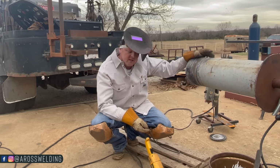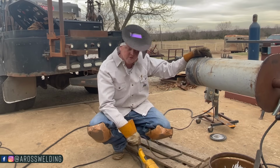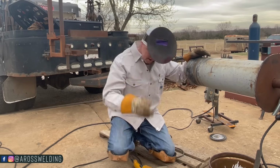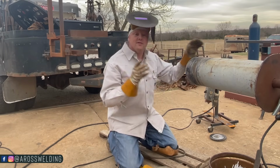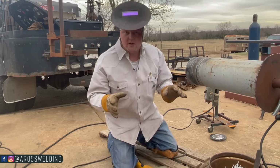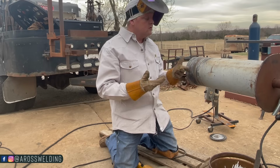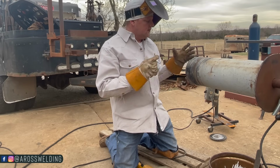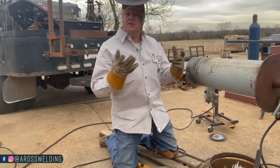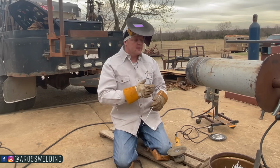Why does that not even sound right? I'm getting that job confused with the 42 inch job I was on. 42 inch, they for sure used automatic welders whenever they were laying pipe, but on this 36 inch, anyway, this fitting crew, I like to take the long way around if you don't notice. The fitting crew, they had 2 welders putting a bead and a hot pass in, and they had 2 welders come in behind that running 7018 for a filler and a cap. It was just part of the procedure. Procedure is just like an order of doing something.